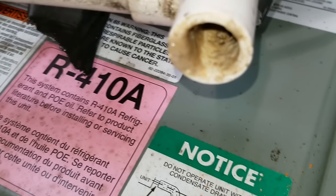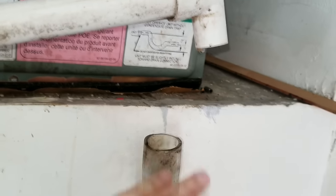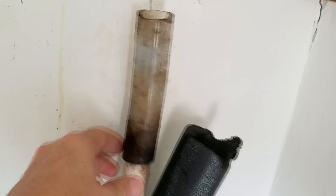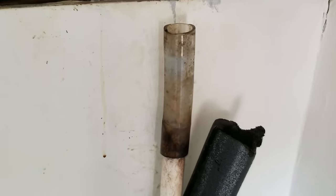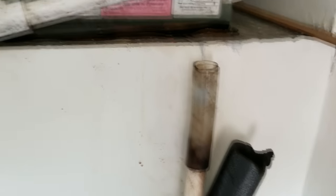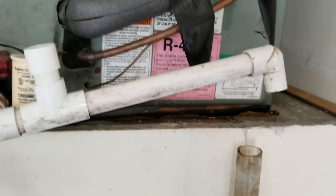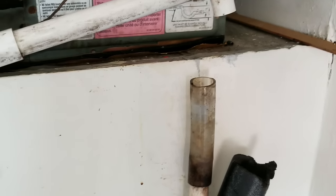There's a little bit of sludge in there — we're going to try to clean some of that out, but it doesn't look that bad. The problem was somewhere further down the line, because earlier when we popped this off it gushed water, and it was stuck right in here. All I did was squeeze it and it was just enough to send that slimy sludge out the other end. We see and do this all the time. This is a great cheap way to clear out your clogged air conditioner line without having to call your repair person and pay $150, because normally they'll insert a pressurized air tool that blows air through — same thing we did with the water.